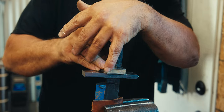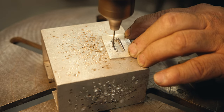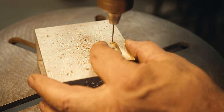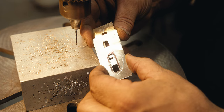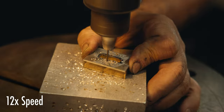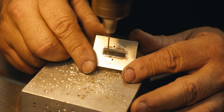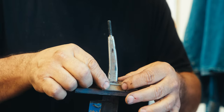Once the sambar stag is wet set onto the handle, then at that point, I go ahead and drill guide pins. That way I can shape the spacer, the nickel silver trim, and start orienting it to the guard. And no matter how many times I take it off or put it back on with those guide pins, which is the top, which is the bottom, those pins will keep everything perfectly in line.